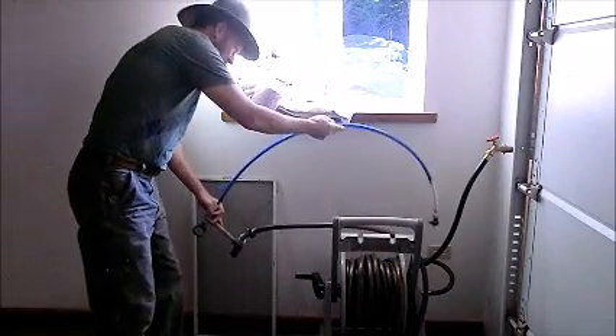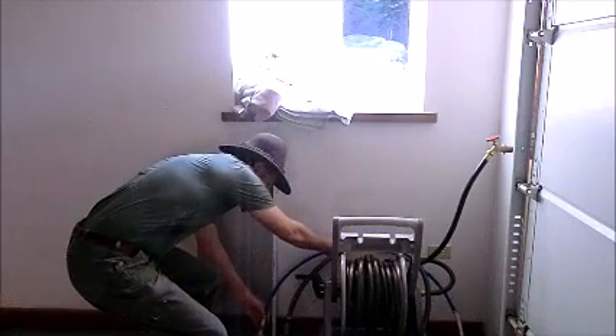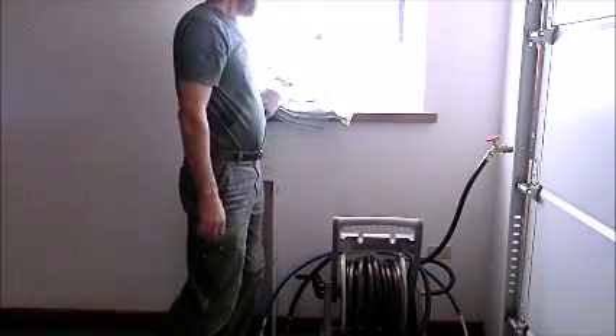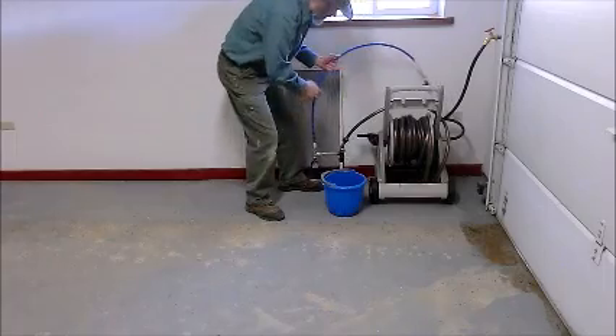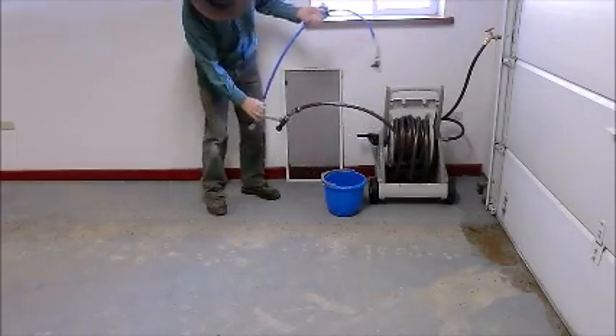It's cracking inside there. We'll just let her sit for a while and come back to see if it leaks. Okay, it's been a few hours thawing out the PEX pipe. She's under pressure — no leaks, all the fittings look good.